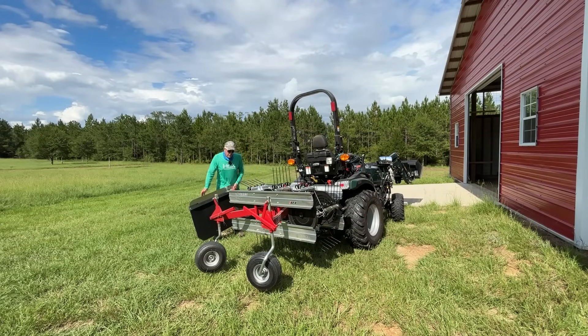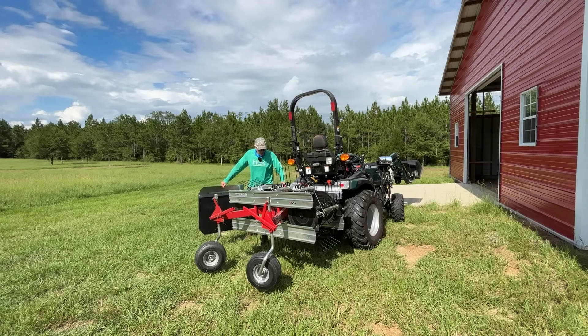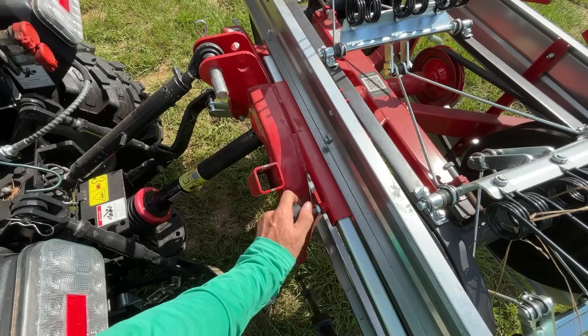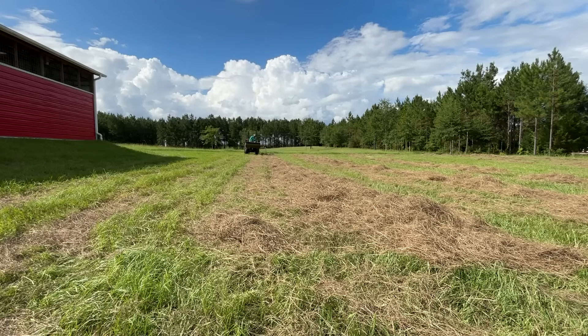This is really only the second time I've used the hay stop. The first time I used the rake I had the windrow too tight. You can adjust the stop in and out — how far from the end of the rake — and what you don't want is a windrow too wide for your baler. It's a mini baler and the pickup is 24 or 26 inches, so if you have a 36-inch wide windrow your baler can only pick up about 75% of it and you'll have to re-rake. I've got the stop at what I think is a good distance, tightened down the jam nut. Let's rake.